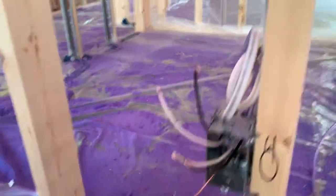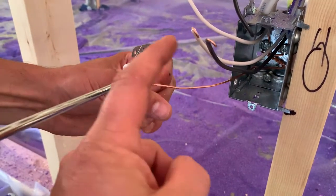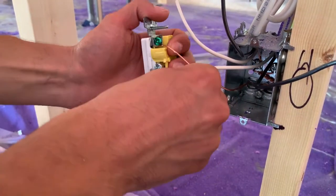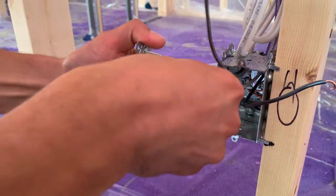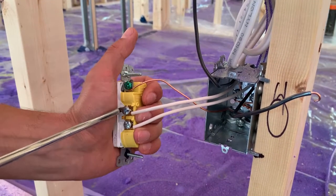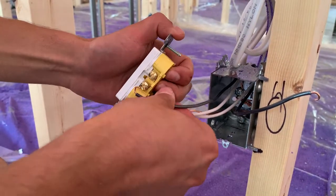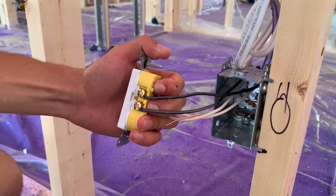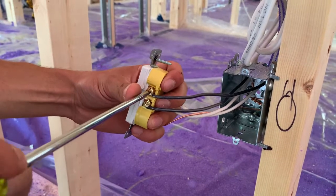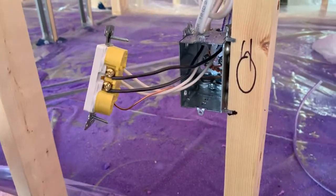He's done the hook clockwise so the end of the hook comes up on the short side, points clockwise, with a loop around the screw — that way when you tighten the screw it pulls the hook tighter. He's doing the same with his whites and then his blacks. We tighten these down sturdy — we don't over-tighten to break them off, and we don't under-tighten. It just comes from experience; you give a good little twist on it.